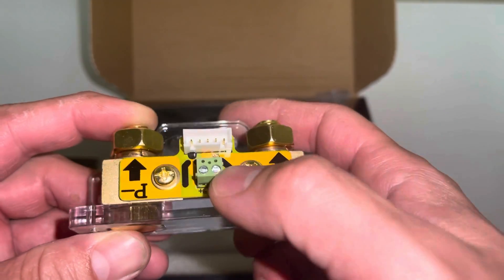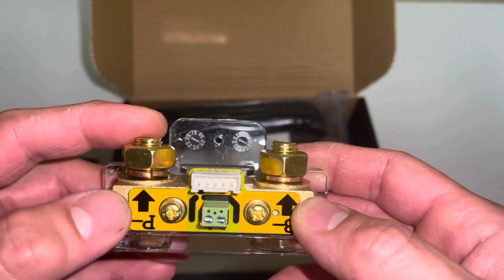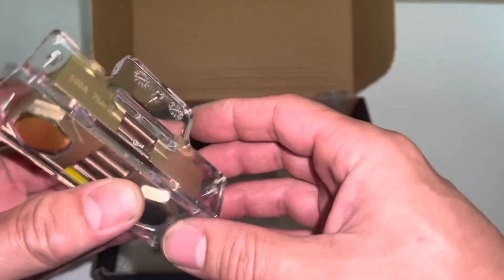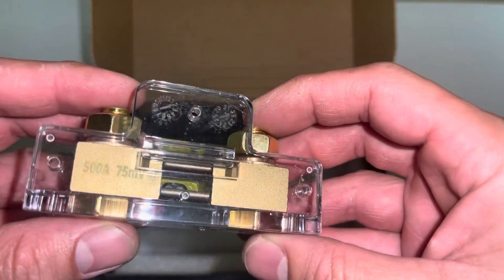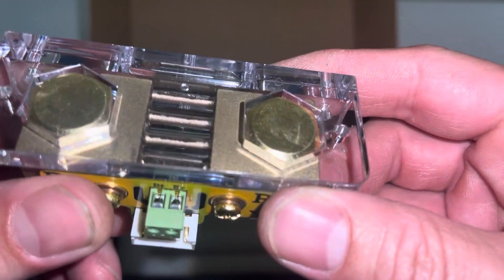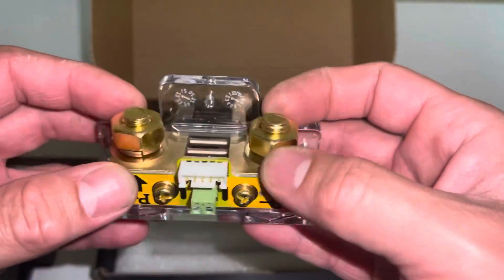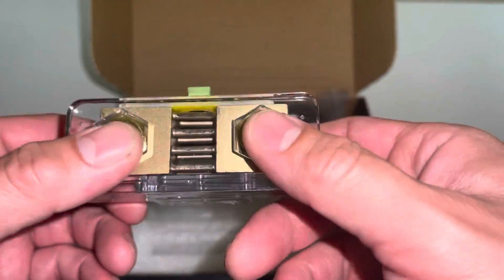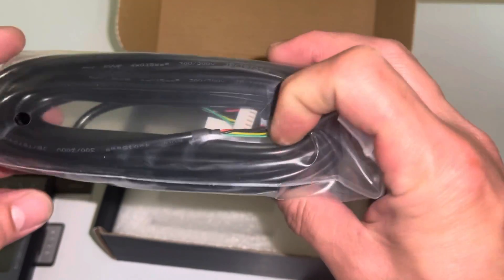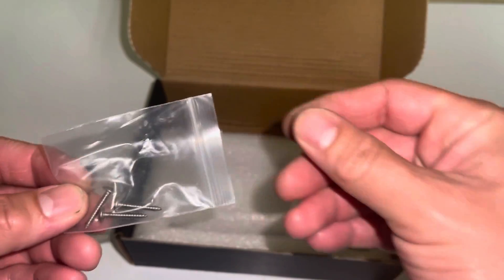There's where the red wire would go in from the battery positive. That's your battery negative and your load side negative. It's very important which way you put this thing, because you can put it in reverse. It comes with a nice little holder. 500 amps — you can see it is calibrated. You've got your data cable, six meters shielded, and your mounting screws for the shunt.